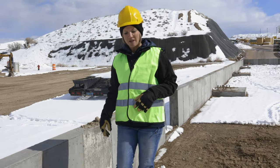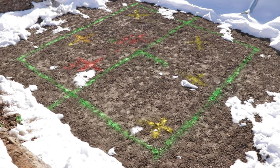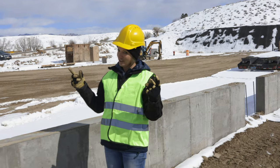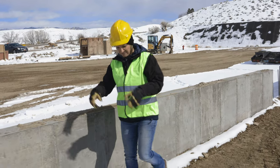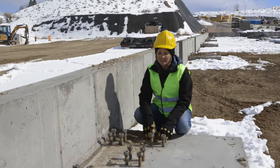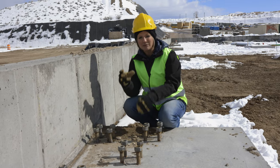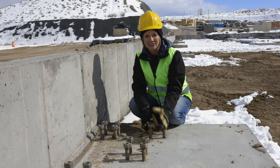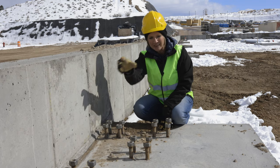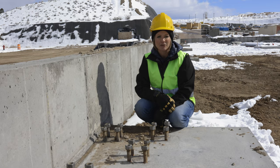As pointed out at the other locations, the X marks on the ground are where steel posts are coming down and will be anchored onto the footing. The footing crew comes right behind us, forms up the footing, and pours it. Their anchors will anchor to those steel posts, and our piles underneath support the load. You saw on some of them that they were very dense and tight — that's because those posts are coming down and anchoring at those exact locations, so we need to be precisely placed.